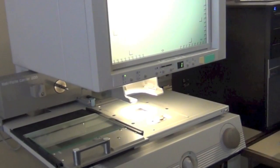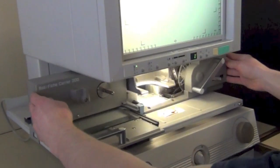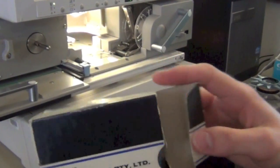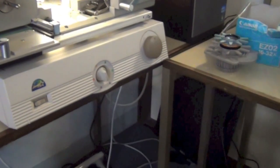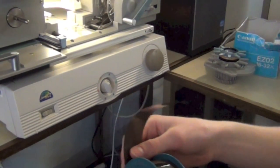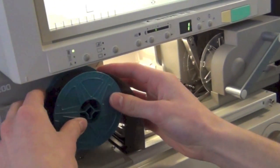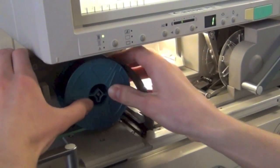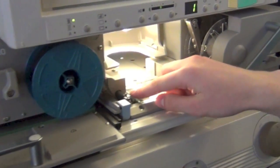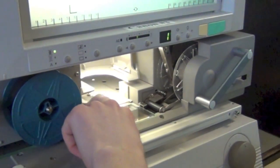Then, the thing that holds the actual tapes, you'll need to bring that forward. So this is our box of film, microfilm — just take it out. Don't worry about getting your fingerprints on the first bit, because that's just all blank, specifically for this purpose so that you don't damage it while you're putting it in. Now, just insert your reel, and then feed it in slowly underneath this little roller, this one here, until it gets to the other side.